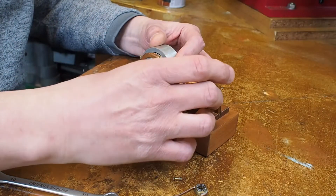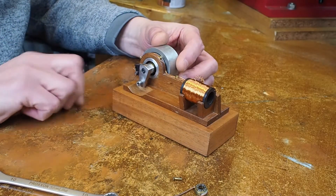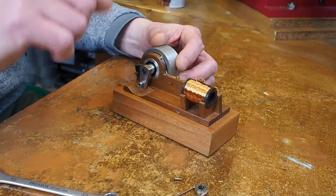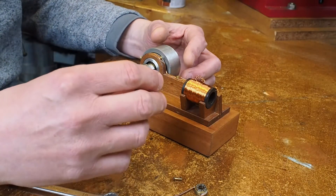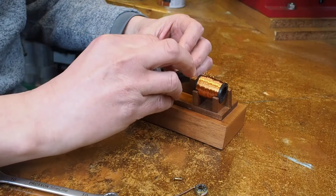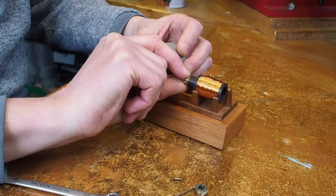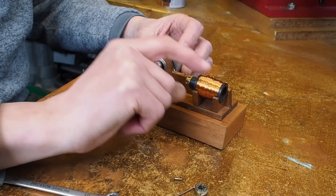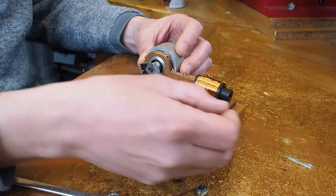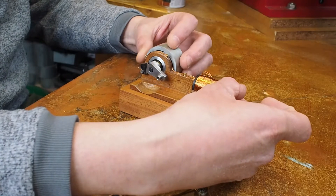So effectively, if I pull it to here and then switch it, it pushes it out. If I push it to here, it pushes it out the other way. That's why the cam operates twice per revolution. When the solenoid armature is at one end, the coil gets excited and it gets pushed this way. When the armature is at the other end and I excite the coil, it gets pushed the other way. So I get two operations and they're only fleeting.